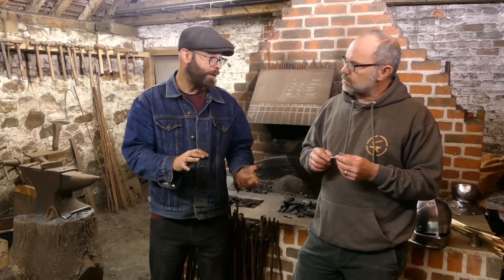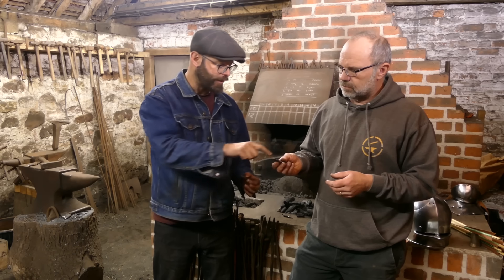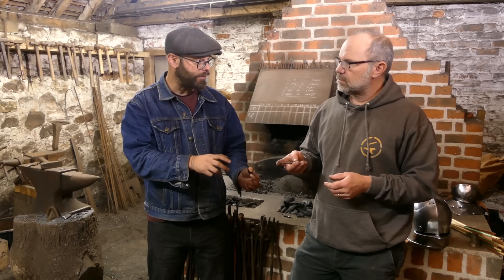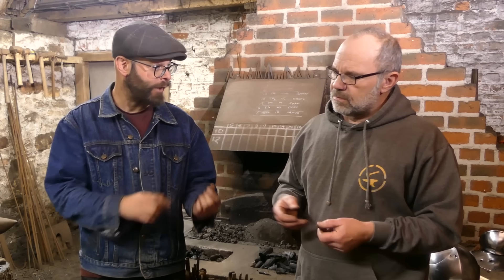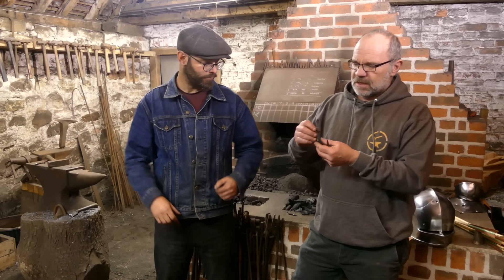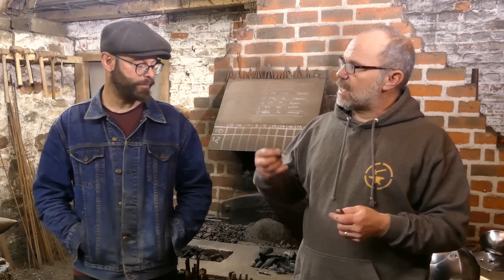The final point we have to make is the weight of the arrowhead. An arrow needs to have a certain amount of weight to work efficiently. For a long time we've been thinking that these are the standard arrowheads, but they're really heavy — more like crossbow quarrels. That's about 25 to 30 grams, and that's getting into too heavy. Whereas these are about 10, going down to six, even five grams. The Westminster Abbey head is three and a half grams we estimate. These barbed Type 16 heads will allow an arrow to travel further because the arrow is lighter. So it bites harder, gives up more of its energy, travels further, and travels faster, which is very often useful for deep penetration.